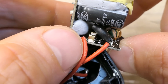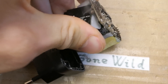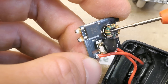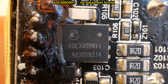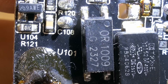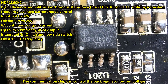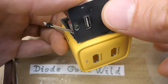There's some interference suppression filter, an NTC thermistor for inrush current limitation, and the fuse. Desoldering this board as well — there's some resin that's going to smoke horribly. Now separated: the interference suppression inductor is now visible, the bridge rectifier, interference suppression inductor, NTC thermistor, fuse — and that's it. Here is the marking of the polymer capacitors, the primary switching chip, the synchronous rectifier chip, the mysterious six-pin chip on the primary side, and close to the optocoupler a three-pin package — is it the voltage reference? The chips on the USB board: probably a MOSFET switching the voltage, the communication chip, one of the buck regulator chips, and a cyan LED that produces virtually no light, especially because of the cover and the bad position of the LED.